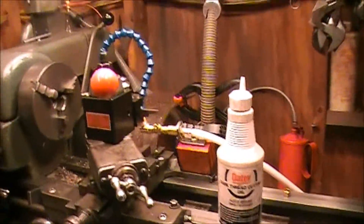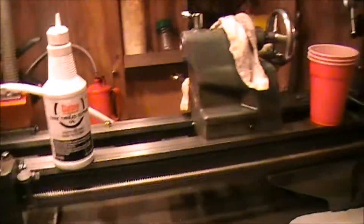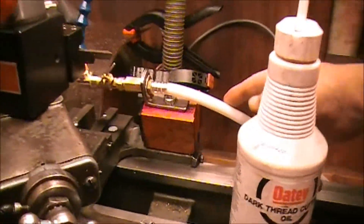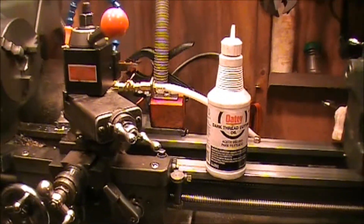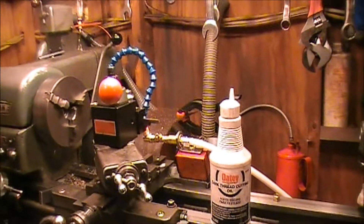Anyway, I thought I'd share this video. For those of you that have lathes that don't have a flood coolant system, this is a pretty neat way to actually get into a system relatively cheap. That trash can right there — I got it at Walmart and might have paid four bucks for it. The flexible line fitting was only like a couple of bucks at Grainger. I bought 20 feet of this line plus the brass fittings and everything — I think that was like 40 bucks. I don't know exactly how much I got in it total; I've never really priced a commercial system.